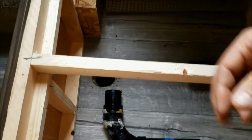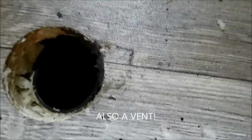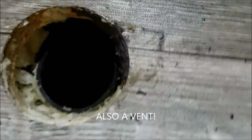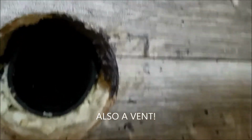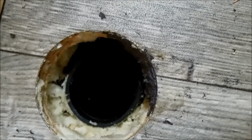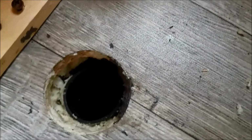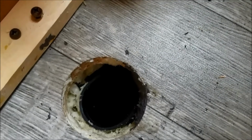So I started with the gray tank, and I have cut the vent pipe, the drain pipe, and found, once I worked it out, that the seal of the tank is rubber. It is pushed through a hole that it fits into, and it sticks upward in kind of a funnel shape and then downward about a 1/2 inch. So you're losing 1/2 inch or about 2.5 gallons of tank capacity just from the seal.